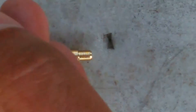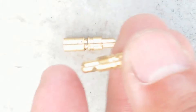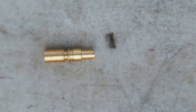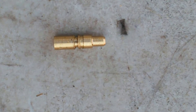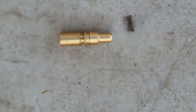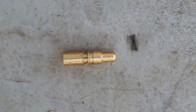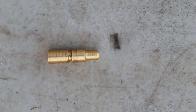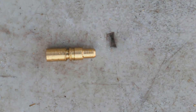I'm using this piece as a setup piece — it already has a hole in the side and a hole in the end which I haven't drilled yet. Now, you can't just drill through the shank that way, because the drill bit is going to slide right off. There's no way to center punch it on a curved surface to get a mark for drilling. So you actually have to make a jig to do that.